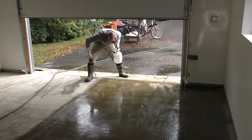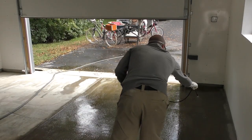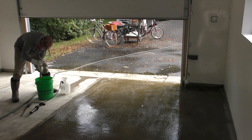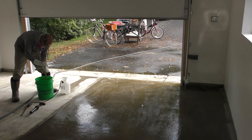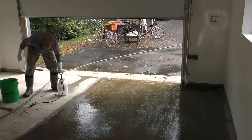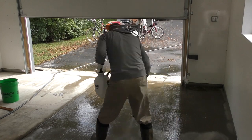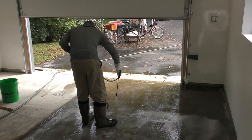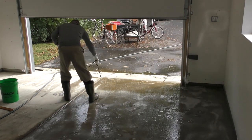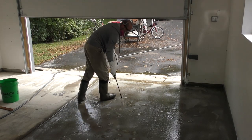The instructions say to let the solution sit for about 15 minutes, but I found it takes about 15 minutes just to empty the whole gallon onto the surface. So pretty much once I finish the solution, I immediately start prepping my sprayer for the neutralizer. I grab my green bucket and re-stir the baking soda because it separates very quickly. Once stirred well, I pour about a third of a gallon into the same sprayer and spray one heavy coat over the area. You'll see the acid fizz and foam when the neutralizer is applied. If you see areas where the acid solution is pooled or thicker, spray extra neutralizer there. Once sections are neutralized, I'll start walking on them, and when done I'll spray any remaining neutralizer on my boots as well.